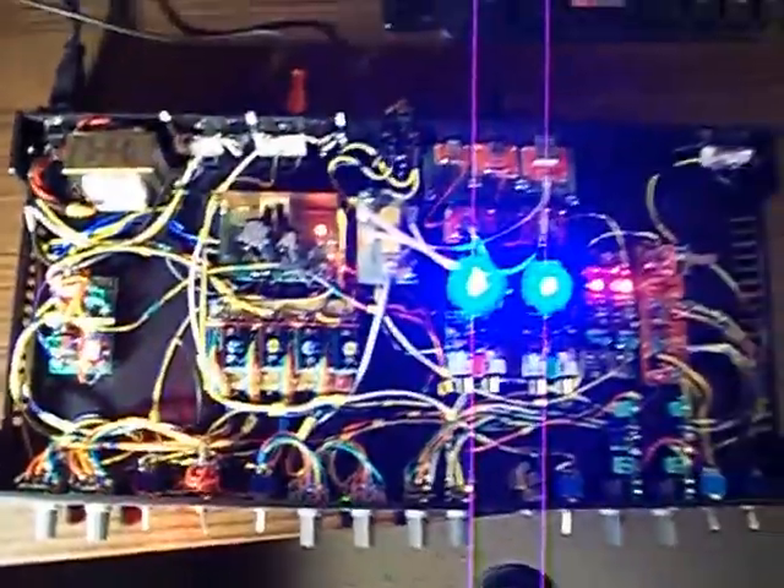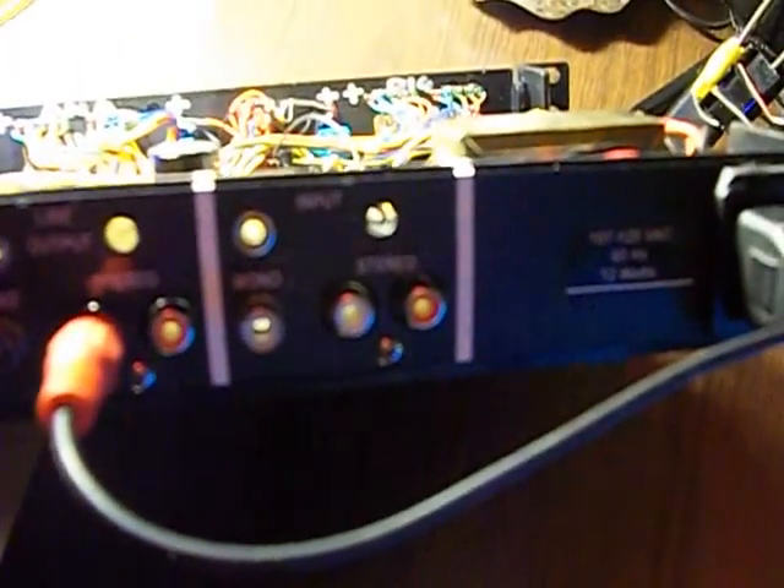Let's see if we can get around here to the back. There you have the speaker outputs, and there are the three USBs. There's a loop-through so that if you want to hook an external compressor, expander, noise gate, tone control, EQ, or something, you can go in and out — left and right. That first group is line out, stereo and mono, with every type of connector you need — RCA or mini phone. These are the analog inputs going from the original source into the computer, and for the inputs we also have mono and stereo RCA and mini phone.